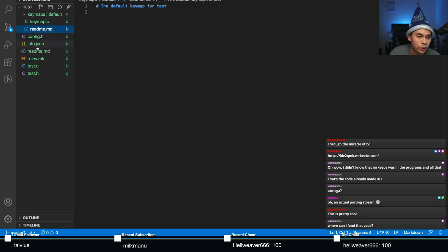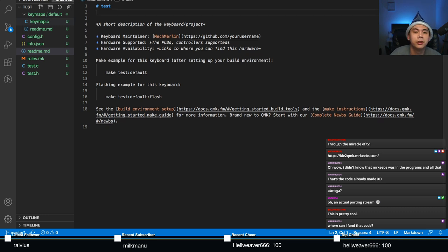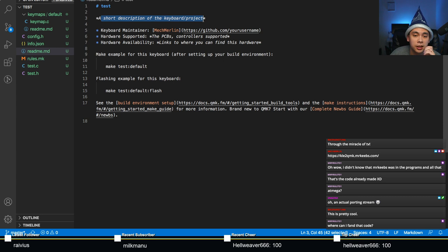So the first thing that I recommend you doing is going to your readme.md. Look at that. It says test. Imgur.com image, replace me. Put an appropriate link in here. If you don't have a link to your image, delete it. Put in an appropriate description. For now, let's just call it test keyboard. For keyboard maintainer, make sure your name is there. And if you have a GitHub, which you should, make sure you have your GitHub name put in there as well. In terms of hardware supported, basically just talk about the PCB, PCB version, all that stuff.